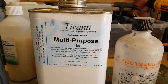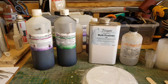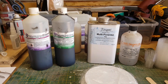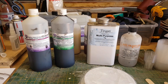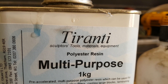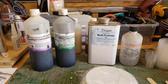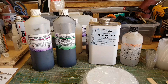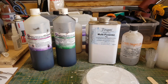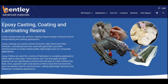The second is polyester resin. If you come to this fresh they probably sound quite similar, but the materials are actually quite different in their use and certainly in the way they smell. Polyester resin in particular has a very strong chemical odor which is quite distinctive. Polyurethane resin on the other hand doesn't have much of an odor at all, and I found it much much easier to use. For many years I was using polyester resin, primarily because it was the only type the art shop near me sold.